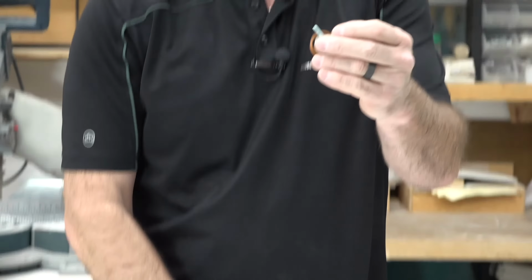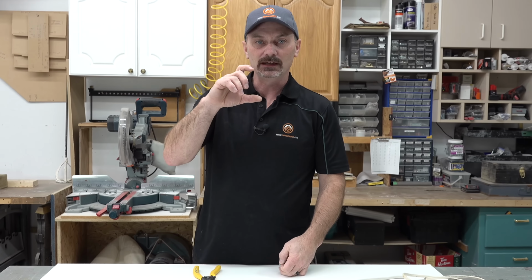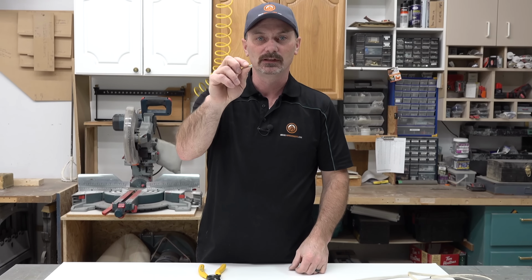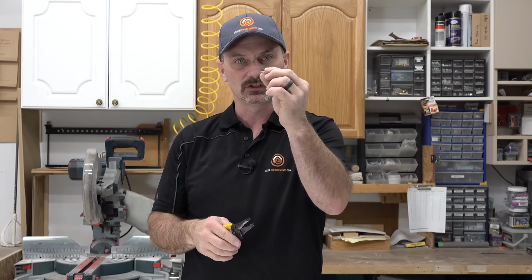Those are actually bolt cutters. Those are made for shortening up the little 6-32 and 8-32 screws that come on a lot of receptacles mostly. Here's a good example. When I do tile backsplashes and I go to put the cover back on a Decora style receptacle, the little screw that holds that plate on is way below the screw that holds the receptacle in. And most times I've forgotten to notch the tile to allow this screw room to go in. So what happens is I tighten that screw, it threads into the receptacle bracket, but then all of a sudden it bottoms out on the tile and I can't get it in tight and it just starts bending the little flange on the receptacle. So all the time I'm using these to shorten these screws.